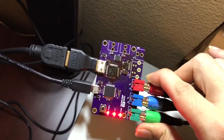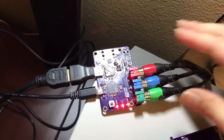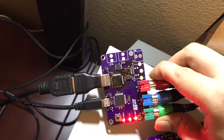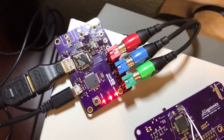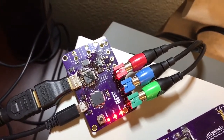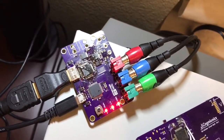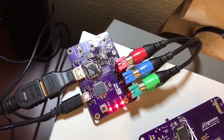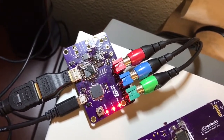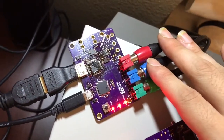Like I said, this is a line doubler. The idea is it takes 240p sources and does the critical job of converting that to 480p. Now, the process of converting 240p to 480p is the toughest part with converting the video signals from these old retro consoles to a modern display, because it usually involves deinterlacing. Most modern displays assume that the video signal is a 480i signal and apply all sorts of deinterlacing and signal processing, which adds display lag and probably corrupts the signal because it doesn't look good for games. It's designed for video. The idea with this device is it does one thing and does it really simple. It just takes a 240p image, line doubles to 480p, and shoots it out through HDMI.